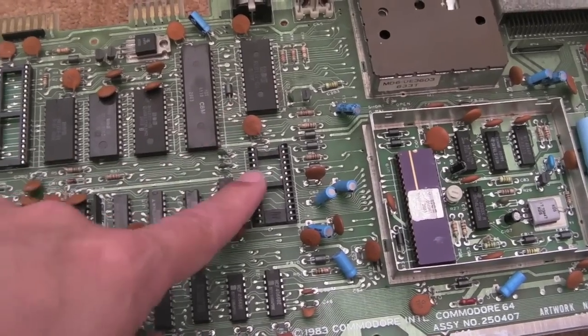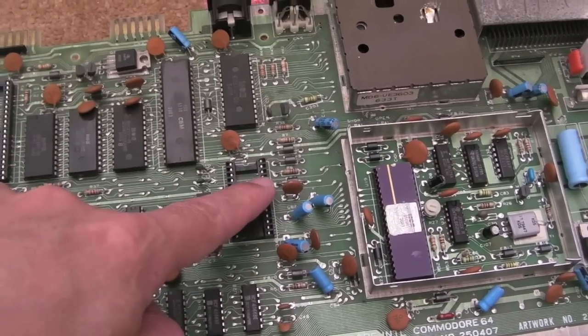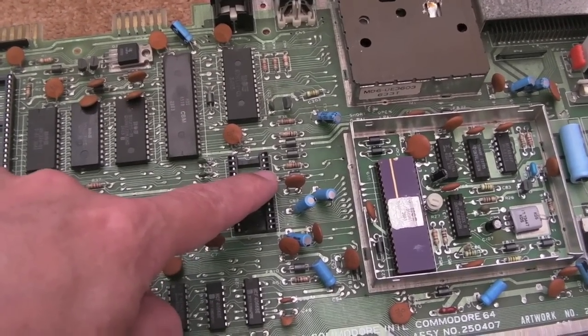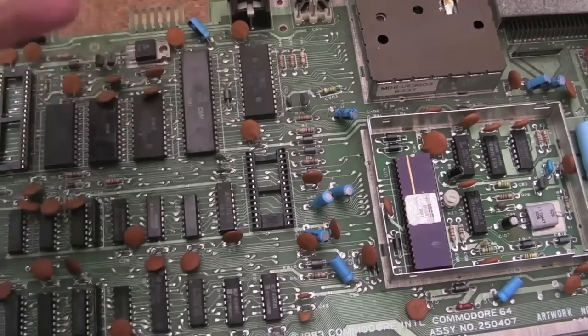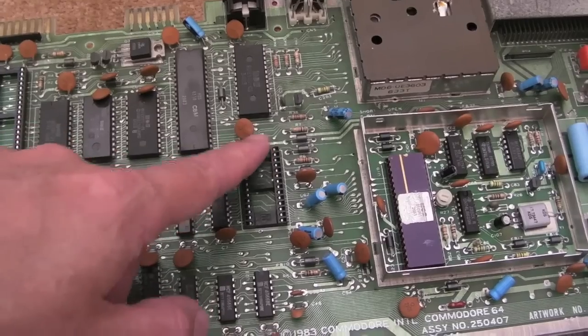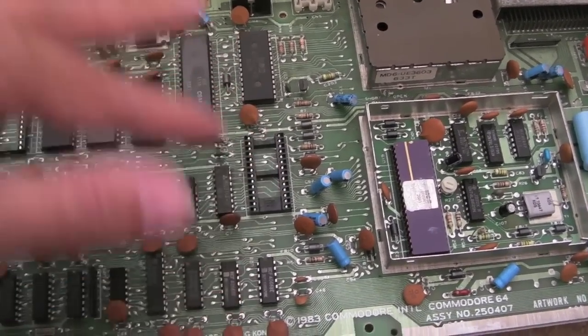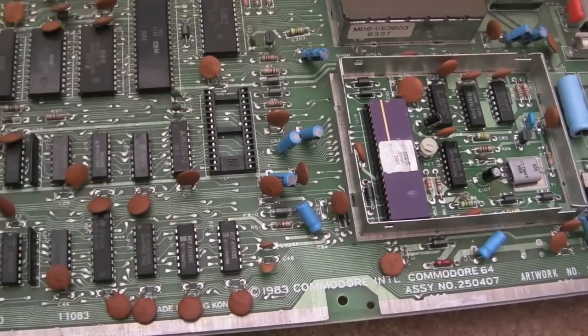The SID I've removed — it's got two pins missing actually. The very tip of one of the pins is missing the very top edge. I'll show you that in another video because I'm going to do that as a separate. I'll Dremel the edge of it and stick it into a little pin, stick pin headers and things underneath it. That'll be a separate video.